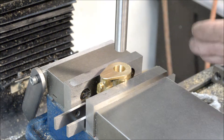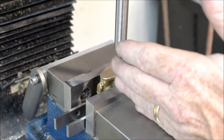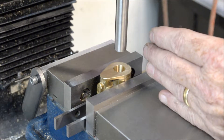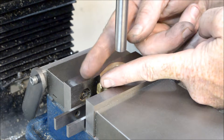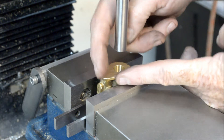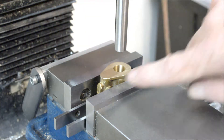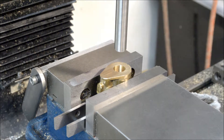What I'm going to do now is move the X-axis 750 thousandths — three-quarters of an inch. I tried to center this in the vise as best as I could. It's a casting, so there's really no definite edges here. There is a parting line here, and I'm going to kind of shoot for that.